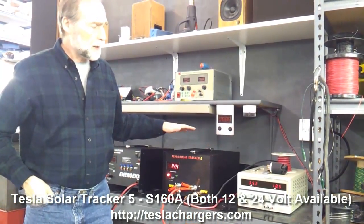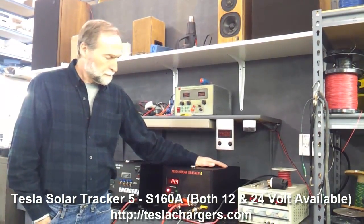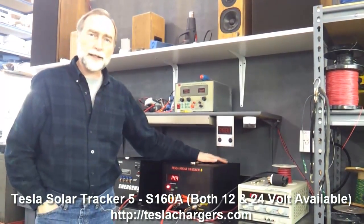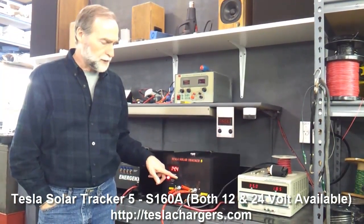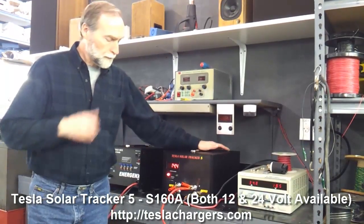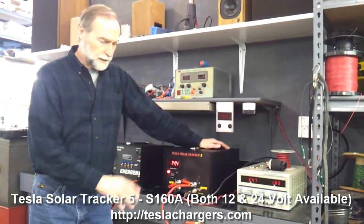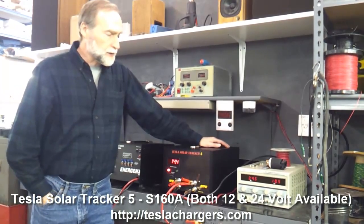This is the standard operation of it. The green light comes on at about 15 volts. When the green light comes on, it'll continue to rise slightly, but it comes on at about 15, which means you've basically started topping. It very gently tops the batteries with very little off-gassing or any other damage to the battery. The batteries don't heat up while being charged this way.